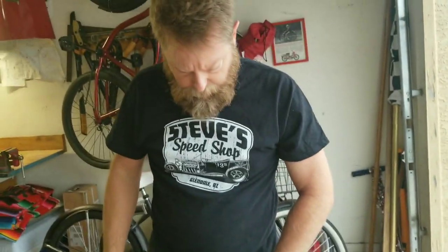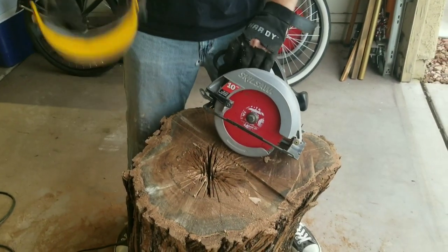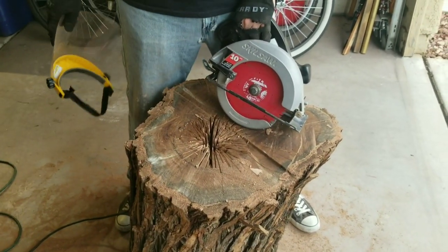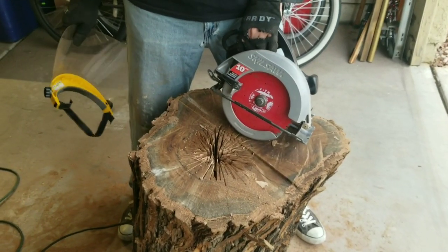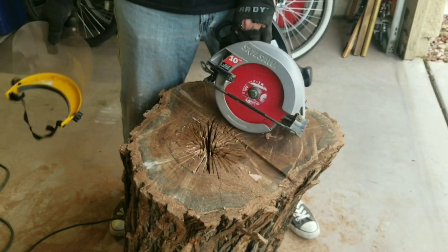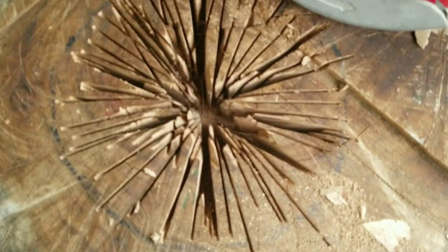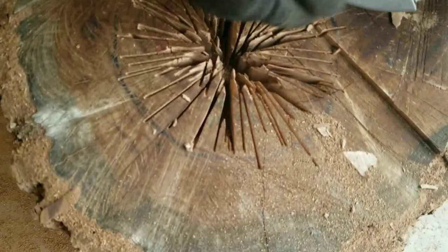To get the general idea, we're just cutting tons and tons of cuts. After I get a few more cuts made we're going to come in and start chiseling out all those little tiny ribbons of wood to make this dish. You can see it's already got a pretty good hole in there — I can almost get my pinky all the way down the side. It's about two and a quarter inches deep based on how much plunge the saw has.